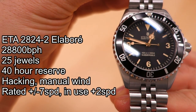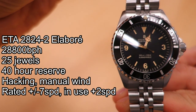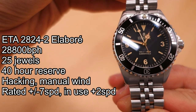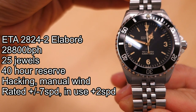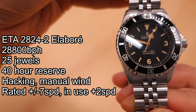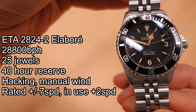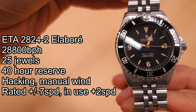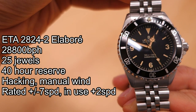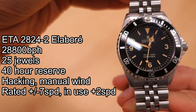Let's talk about the movement. The movement in this particular piece is an ETA 2824, in this case in elaboré grade, as are all the Steinhardts I have reviewed on the channel. It is excellently regulated — you can see the expected accuracy there — and this is actually running plus one or two seconds per day in the week that I have had it, which is very, very good. Steinhardt really do a good job regulating their movements. Note that this is a no-date watch; the 2824 usually does have a date, but they've chosen not to implement it, which I think is a right decision.